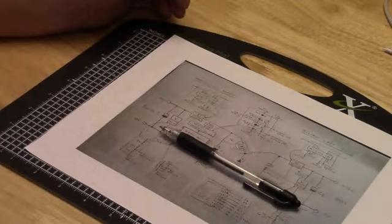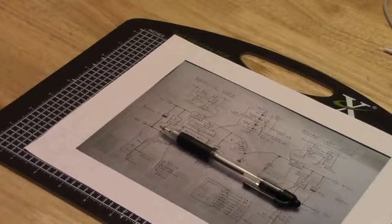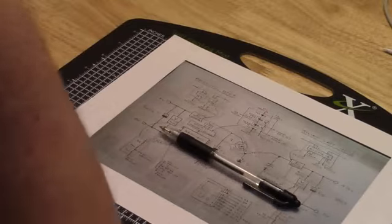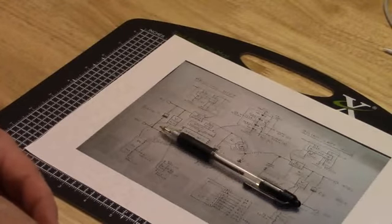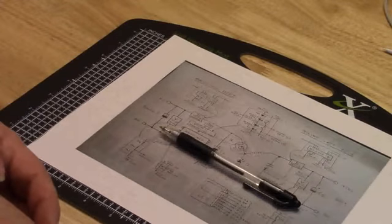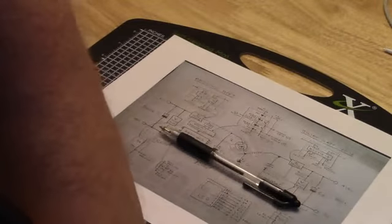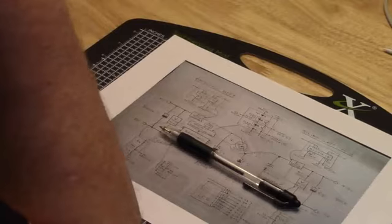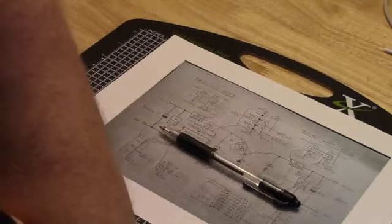And what I have been thinking about is putting a solid state relay instead of a normal relay that will be redirected out to the dump load. Because like I said, I'm introducing a dump load into an atypical solar charge controller that's not typically there. It's not typically needed. But I'm using it as a way to maximize the use of the panels. Because if it's just sitting there like a rock, and your batteries are fully charged, then are you really getting your full money out of it? My opinion, no. I'm looking at putting in 6,000 watts.